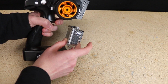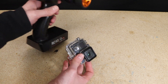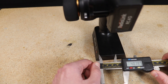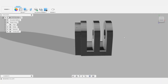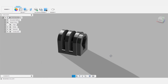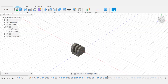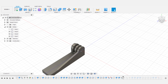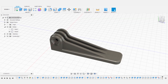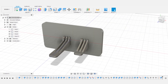Since I wanted a mount on the bottom section, I roughly decided where I wanted the camera positioned so it doesn't get in the way of the throttle. I also took a few measurements so I knew how big to make the base of the lower mount. I already had the mounting section where the bolt slides through designed from a previous project, so I used that as a starting point. I'll be uploading just this mounting section in an editable file format on Patreon for anyone who'd like to use it. I made one mount for the bottom and then copied and shortened it to make the mount for the top.